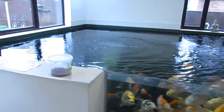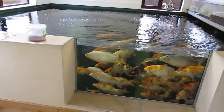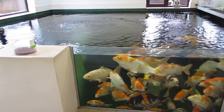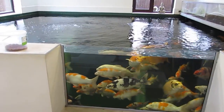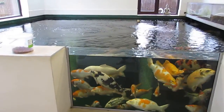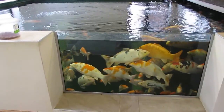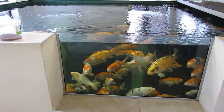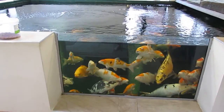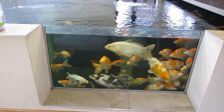Like I said, if you're building your koi pond, you can insulate the walls. If it's not insulated, that's not a problem. It doesn't matter. The main point is covering your pond up. So just to put that heater on at 4 degrees, if it's covered up, you'll probably not see it on very much, and not on enough to use any electricity during the winter periods. It's just that fortnight to 3 weeks where your pond might actually drop below 4 degrees, it'll be coming on not an hour a day, and that'll cost very little to run.